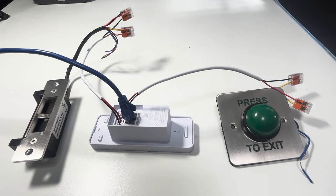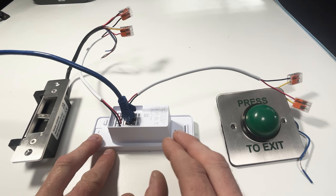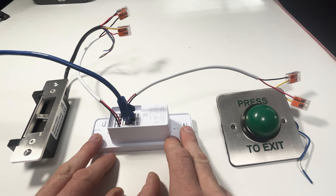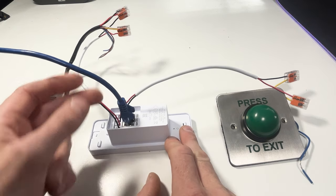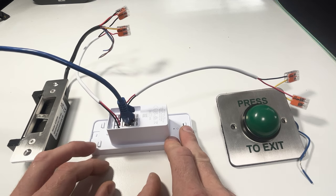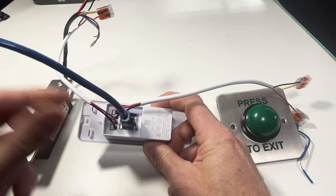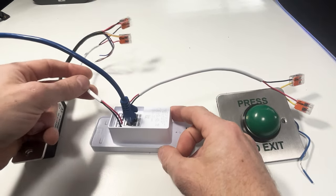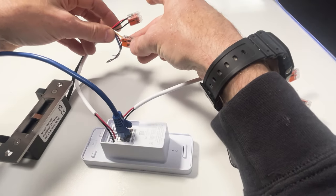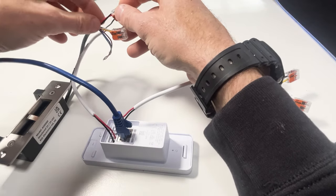Here I've got my little setup — the Access Ultra sat on its front, with the electric catch lock and the push-to-release button. The wiring is exactly the same as for a mag lock; I'm just using a catch lock because I had one available. I've run Cat5 cable into my Dream Machine SE, which provides the PoE+ power the Access Ultra needs. Out of the lock terminals on the back, I've run Ubiquiti access cable into some WAGO connectors, which provide the connection to the lock cables.